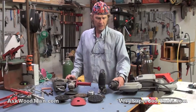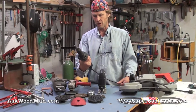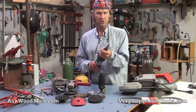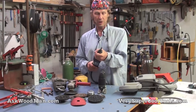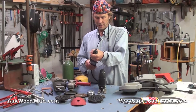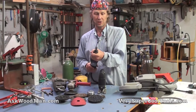The other tool that's really handy is a little die grinder — this is just a $99 Makita, and this is as big a die grinder as I want to own. The angle grinder and this are definitely two-hand tools. You've got an exposed cutting barrel of solid carbide that will basically float, feather, and bevel steel like it's nothing. It's spinning at 25,000 RPM, so two hands on this thing at all times.